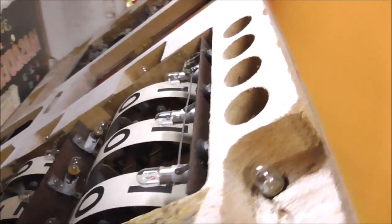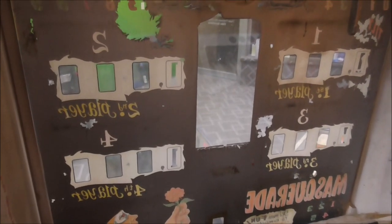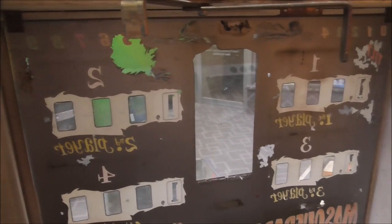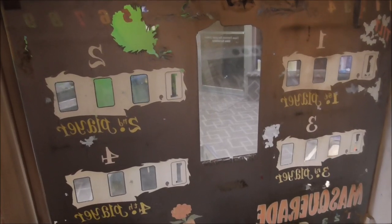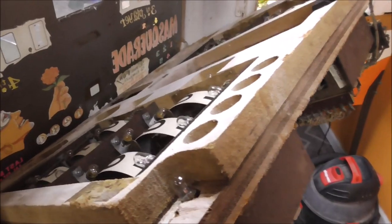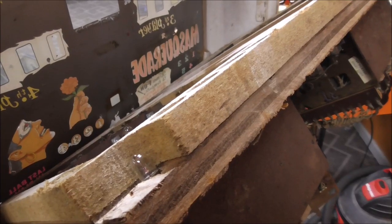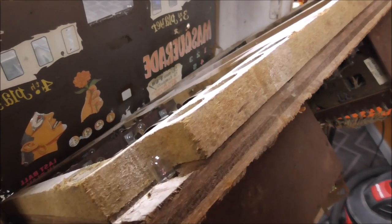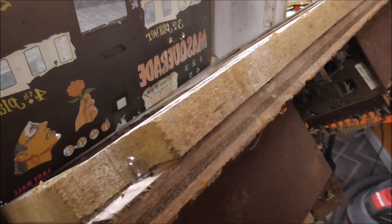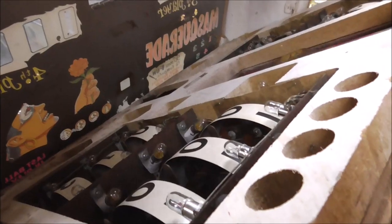Okay. So I replaced most of the bulbs. I can do most of the rest of them after we take the back glass out, but I can do them now. You don't have to take the back glass out to do that, but it'll just be easier. So I'm going to slide this back glass out so that we can paint it up in the next video, because we're about as far as we can go on this back box until we get parts in. There are some little clips that I need, and I ordered a replacement 30 volt hold coil. And I need that replacement bell. So there's a little bit of stuff that we still need for it.